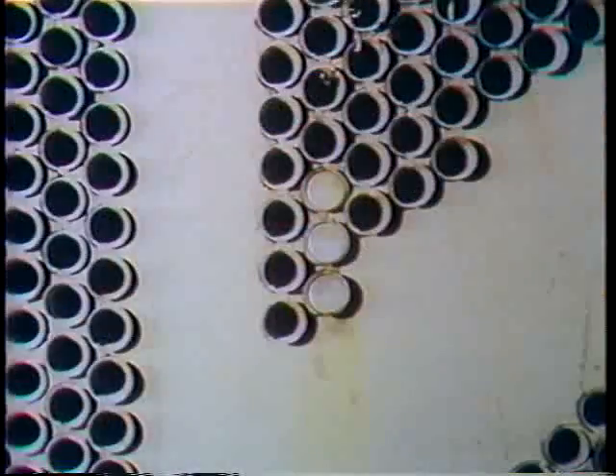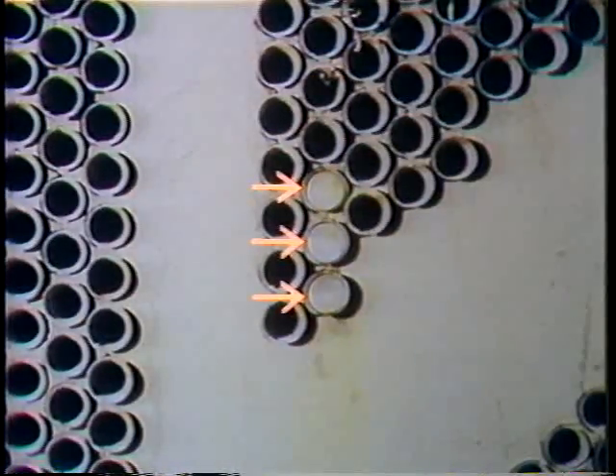You can even tell how bad the leak is — if it's a big leak the wrap may be sucked in so hard it'll pop in the opening. Other substances can be used for this test; a soap and water mix or foam can be brushed over the tube sheet — where bubbles are sucked in reveals leaking tubes. Wherever a leak is found, the tube is plugged at both ends so cooling water won't get into the condensate when the system's running. Tubes are plugged instead of repaired because it isn't possible to get into the tube bundle to all the places the tube might be leaking.